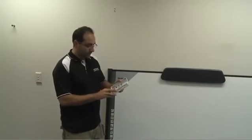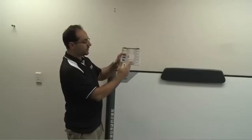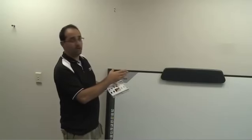We're now at the next stage where we mount the wall bracket to the wall, and in this case we're mounting on a plaster wall, so we will prioritise the positioning of the projector wall arm so that the stud will line up with the bracket. But if this was a wall made of a solid material like brick, we would prioritise the positioning of the board to the ideal place, and then we will offset the projector to the right.